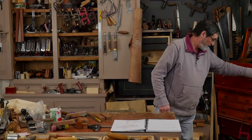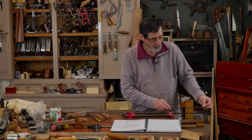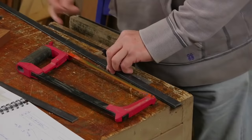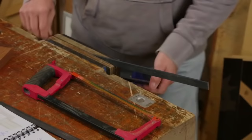So we're going to cut a bar to length first of all, just for those of you who have zero metalworking skills. This is my overall length here. I'm going to use a pencil or a nail. You can use either. In this case, I'm using a nail to mark my stock. Secure it in the vise, nice and solid.